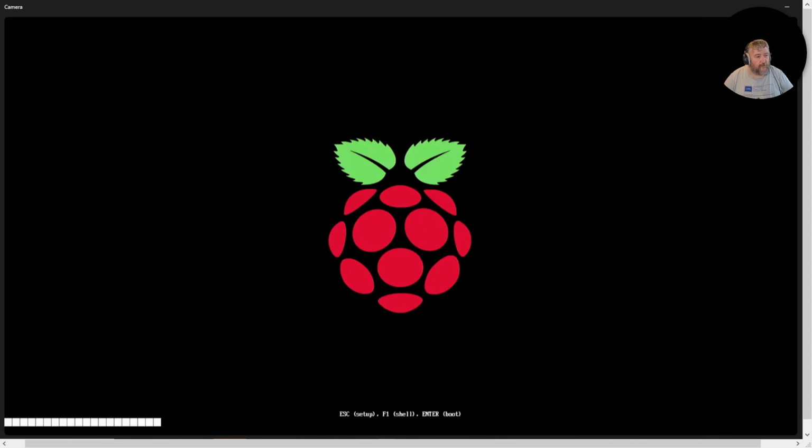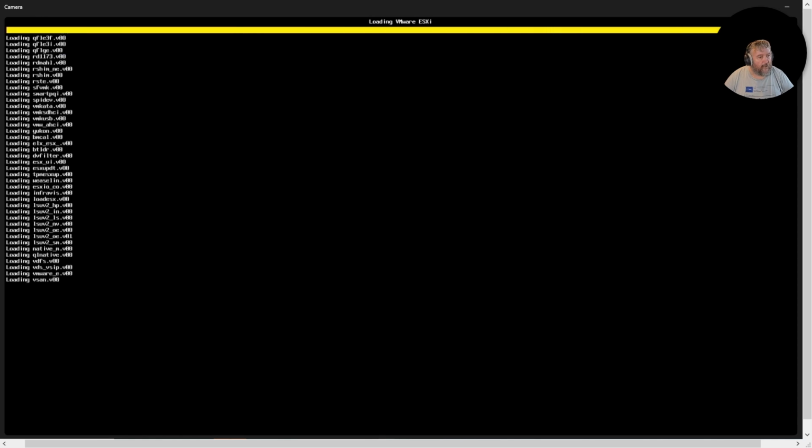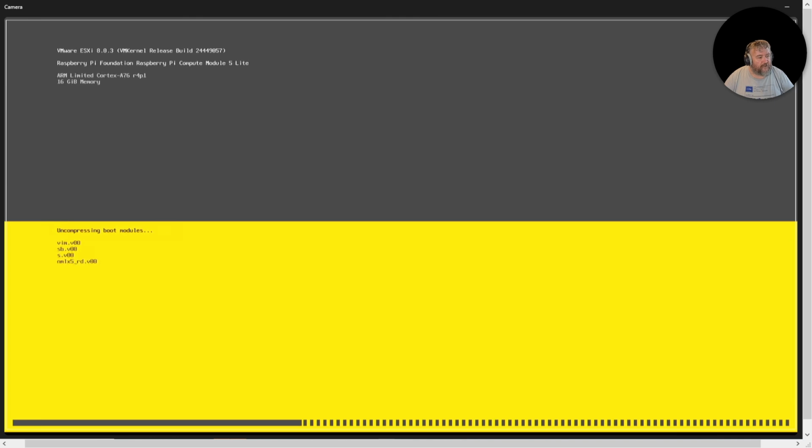So here we are. First time. CM5 Compute Module 5 with a D0 stepping using the latest bootloader that came out on the 9th and eventually went into production, I think, across the repositories on Friday the 13th of June 2025. Unlucky for some. So this is a 16 gig version which has the D0 stepping, but oddly I found that the 8 gig version, although not having a D0 stepping, wasn't working properly with the frame buffer either. So both the 8 gig and the 16 gig versions, irrelevant of the D0 stepping, both updated to the bootloader that was released on the 9th of June or the 13th of June.